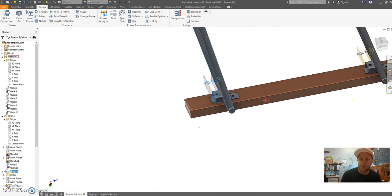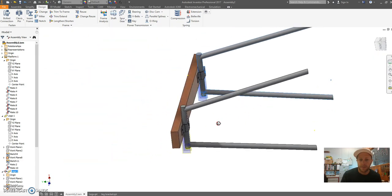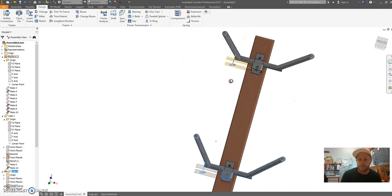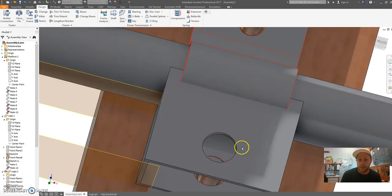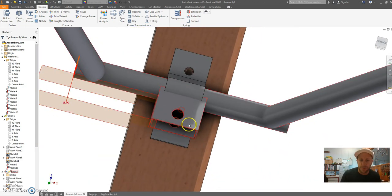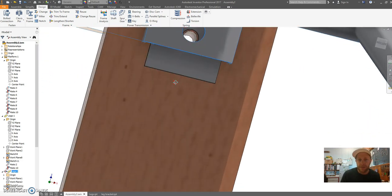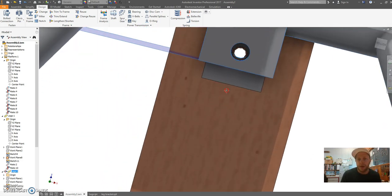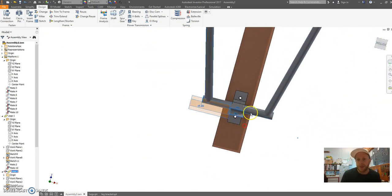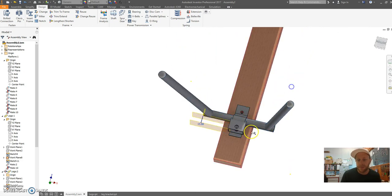What we need to do here is we need to add, I can go back to where I was. We need to add a clearance or a cutout here to allow that saddle to pass through. So we'll fix that up in a sec. And the other thing we need to check is that if you look down, you may or may not have that hole in the right spot. So I had 12.5. We might need to tweak that. So it probably is about 10 millimeters from there.